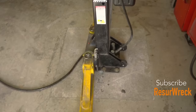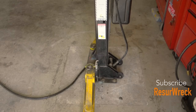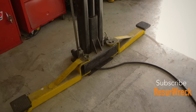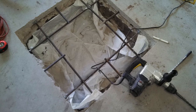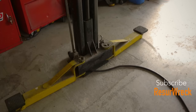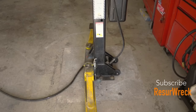Now my floors are three inches thick, which is what I found out when I started drilling holes in them. You really need four inches for this to work properly. So I had to cut — you can see right there — I cut an area of about 36 by 36 inches. I used a regular circular saw with a concrete blade, cut holes in my floor, and dug a hole 12 inches deep. I reinforced the floor with rebar and used concrete with the highest PSI possible — I got 3,500 PSI concrete, and they recommend 3,000. I used fiber-reinforced mix; I wanted to make sure this was as strong as possible. So you've got a 12-inch deep slab that's tied into the existing concrete.